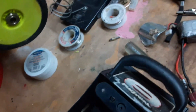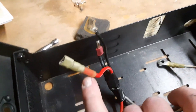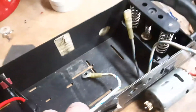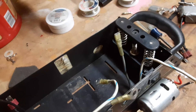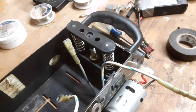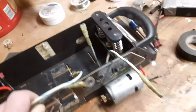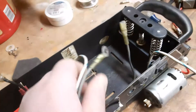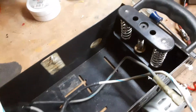So those two go to that. Battery there, switch wires there, these two go to that, and when you push it down it's supposed to turn on. Well, what's happening is when I plug this — which goes to the motor — and I plug it to the motor with the battery connected, I flip the switch and it just comes on automatically. I don't have to bump it. So I've done a few tests to check some things out. What I figured out is that if I run power through these cables here it works — it's like it's already connected. I don't have to do any of this.